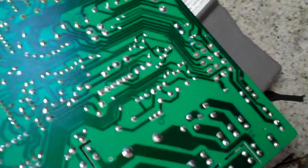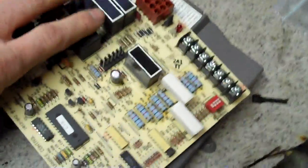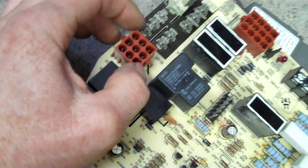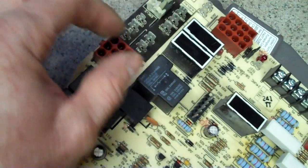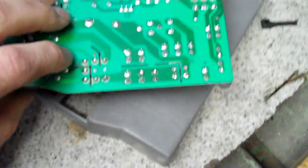The main thing you do when you do a computer repair on a circuit board like this one — the problem with it is this group plug here. Basically the furnace wouldn't come on; it was giving code 32, a ventilation draft problem. And it's because of this circuit and this plug. If you'd wiggle the plug, the furnace would kick on and work fine.